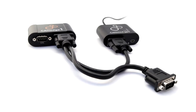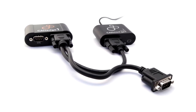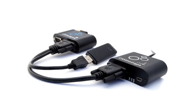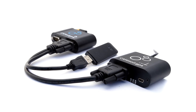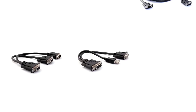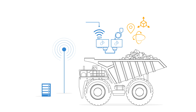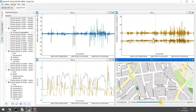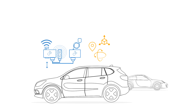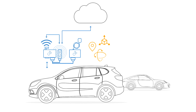Another popular use case is to deploy the CAN mod GPS as an add-on module for the CAN edge CAN bus data logger. Simply configure the CAN edge to provide a 5V power output via the second port, then connect the CAN mod GPS via an adapter cable. This lets you record your vehicle or machine CAN data via channel 1 and time-synced GNSS and IMU data via channel 2. For example, you can use the CAN edge 2 to collect both your vehicle and sensor data and send it to your own server via Wi-Fi or cellular access points.